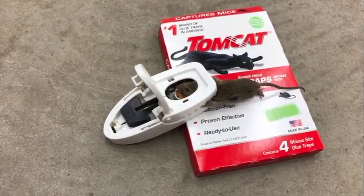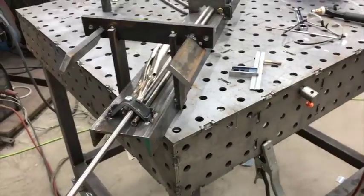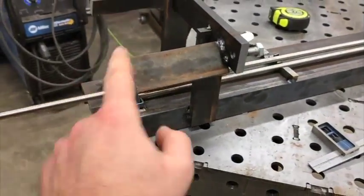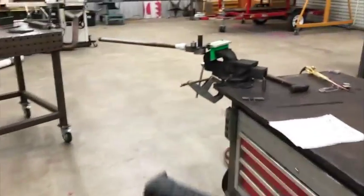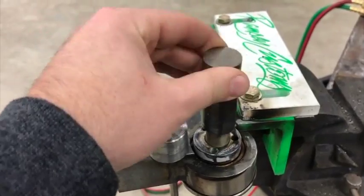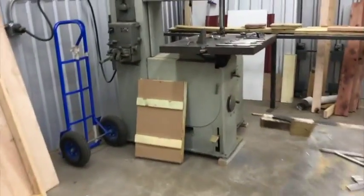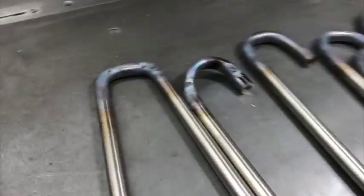Sunday morning — I've been working on these guys. This is one that they gave me. I was just about to bend the ends of it, and before I did I stuck some scrap in there to practice making this bend. I turned these down on the lathe — already had this one turned — and that really helped get a much smoother bend without as much heat. You can see I did a lot of practicing and had a few failures.